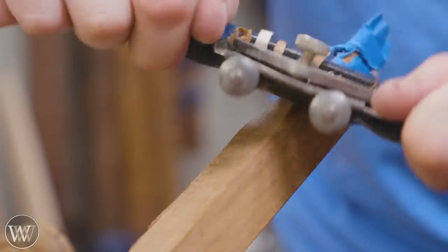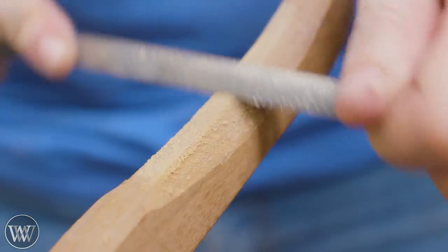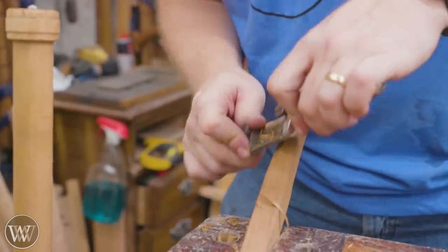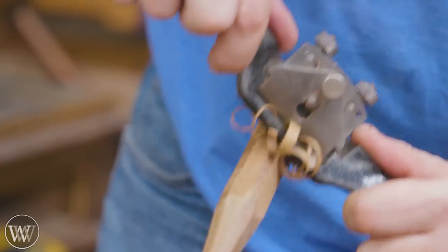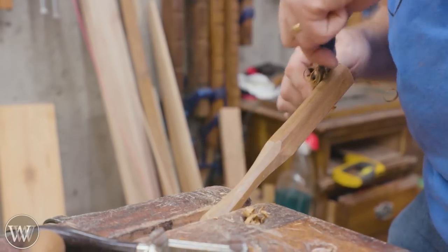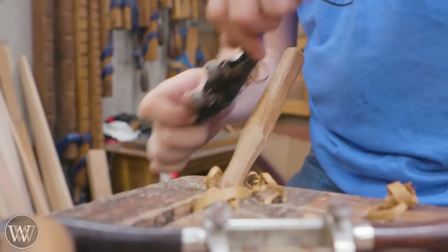For this one, I'm going to do more of an English pattern - actually more of a London pattern - which is what you think of with an old-style hammer. It has that octagonal shape up by the neck and swoops in a little bit. At the very top by the swell, I'm going to taper it down to the tenon. A rounded body spokeshave can really come in useful - you can get into these tight radiuses and work on it. Slightly farther down from that swell, we're going to create another octagon, but it's an elongated rectangular oval-ish octagon as opposed to a square with corners cut off. The handle is going to be turned into an oval so it feels better in the hand - the standard pattern has it turned into an oval.